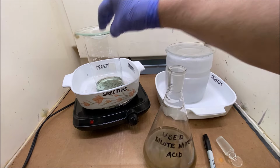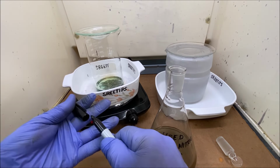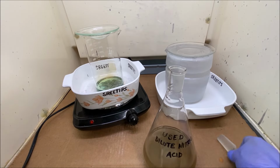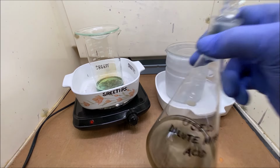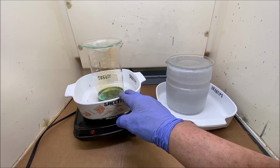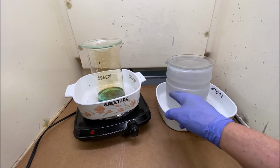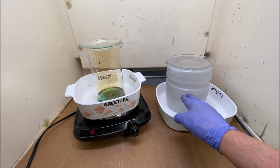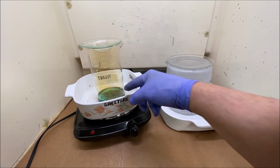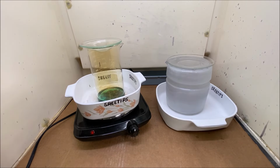And this will be the first nitric acid boil. I'm not going to show each one. The next time we come back to do the video, to continue the video, all the silver and base metals will be pulled out of here. I empty that liquid into this silver jar and save it because it's going to have silver in it. When we come back, we should have all that pulled out after about 4 or 5 nitric boils.